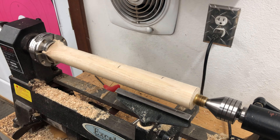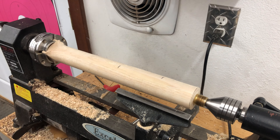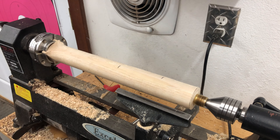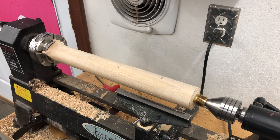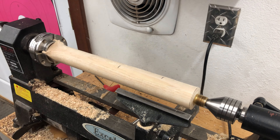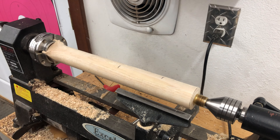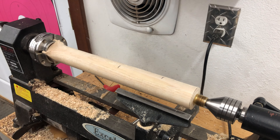I've got it sanded down to the grit that I like and it feels nice and smooth. I'm still going to put a finish on here and do a little more polishing on that ferrule. Let's throw a little finish on it — I'm not going to get too fancy. I'm just going to put a few coats of tung oil on it. It doesn't need to be anything more than that; I'm not going for a high polish. I just want to nourish the wood a little bit. Put a good coat of tung oil on there, let that soak in, come back, part it off, and then we'll seat the handle.